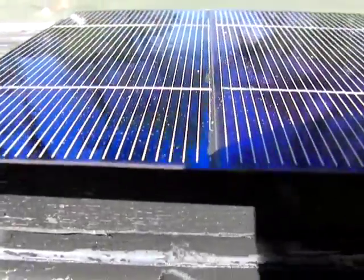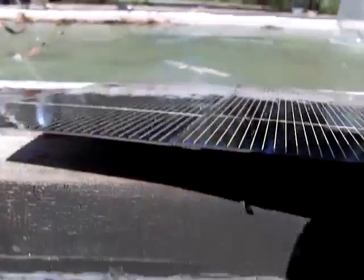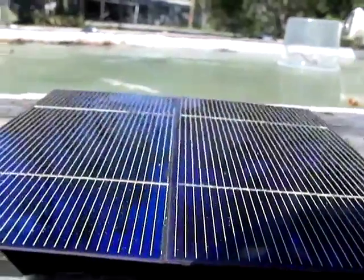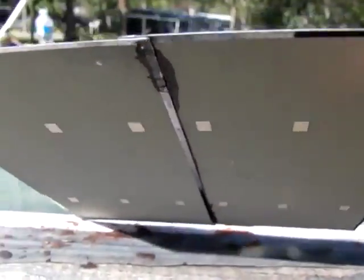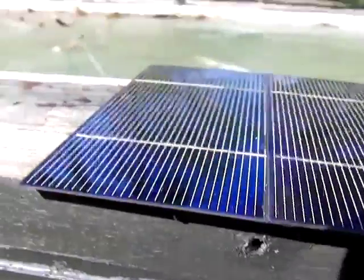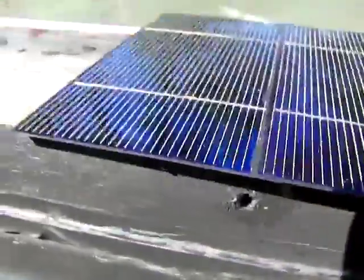The way that you glue these together is you just put one right on top of the other. You can see there is a mild junction. The entire back of the solar cells — that whole gray part — is actually conductive. It is not just the white junctions. Those junctions are simply to give you something good to solder to. The whole front on these, any of the white lines, are conductive as well.